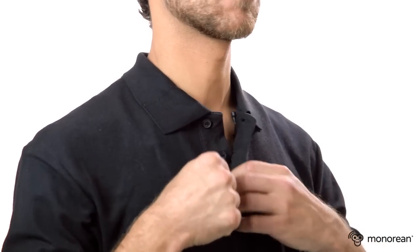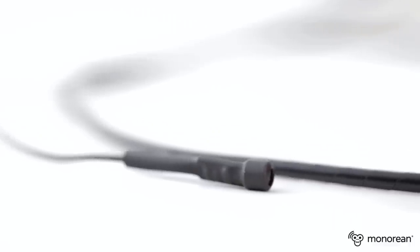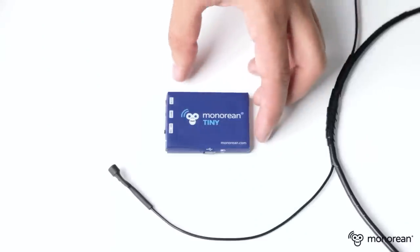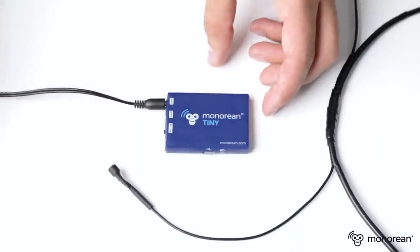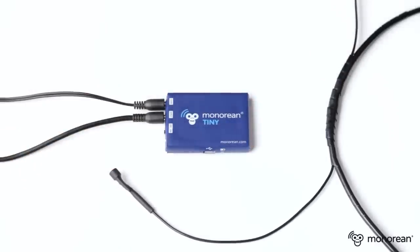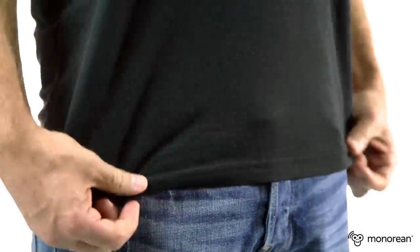Place the inductive collar around your neck. In order to hide it better, you could wear a t-shirt and secure it with plaster or tape. Place the microphone inside your shirt collar. Because it is a highly sensitive microphone, talk in a normal tone. There's no need to direct your mouth towards the microphone. Connect the inductive collar to the switchboard through the input labeled 'loop'. Connect one end of the cable to the switchboard through the input labeled 'input'. Finally, connect the cable to your cell phone or MP3 and appropriately hide the switchboard.